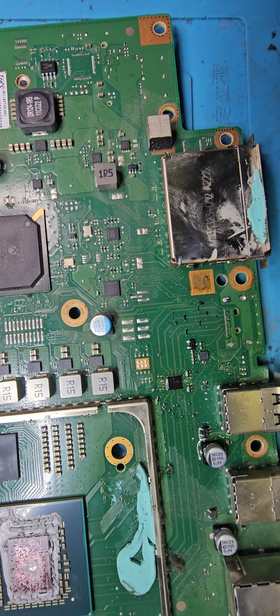So these two on the other end here, these ones, they are connected together because you can see it's actually wider than this other side. And when you're checking it under the microscope, they are not together. When you're checking it on this motherboard, then you will have to use a microscope. So you can see they are not connected together. So I created two bridges which are not supposed to be there. It's just that it's wider on this side, so you'd assume that they are actually connecting together down there. Same goes with here. So yeah, let me kill that bridge as well before it kills me.